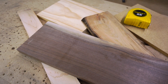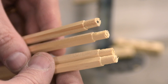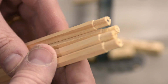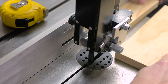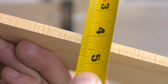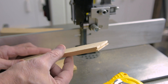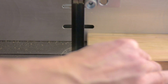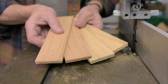I began collecting measurements to determine how many standard pencils I could get out of a typical piece of scrap wood. I decided that I could fabricate four pencils at a time if I had a piece of scrap that was two inches wide, eight and a half inches long, and three quarters of an inch thick. These little boards would then have to be re-sawed right down the middle to create the two halves of a pencil sandwich. I also prepared some black walnut, some white ash, and some cedar to cut, and you'll see those later.